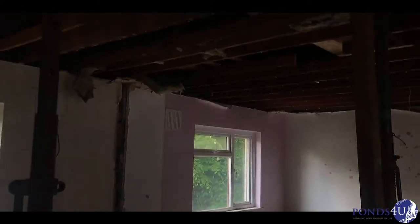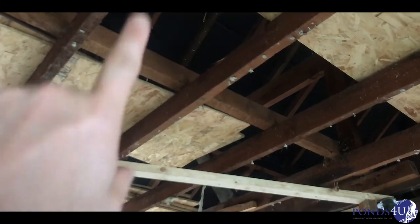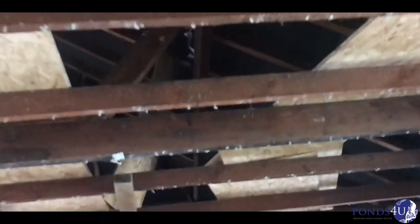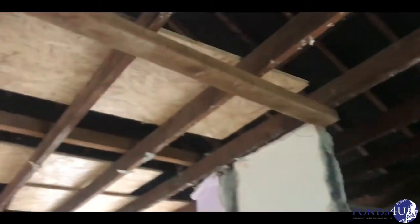That part of the roof there, the angled part of the gable, is coming off and that's where the dormer's going. The front part is just having two veluxes. And the hip, which is that side bit coming down like that, will have to go up straight and there'll be a new gable blockwork wall going up there. So we need scaffolding.